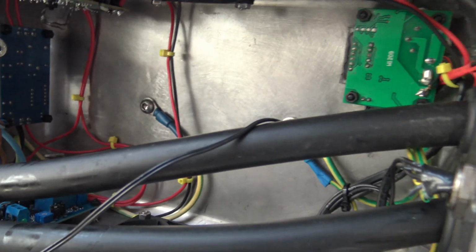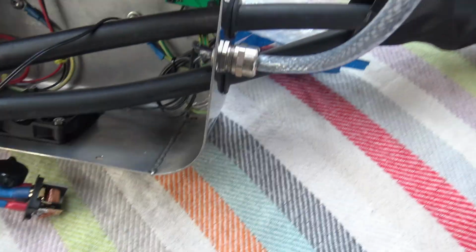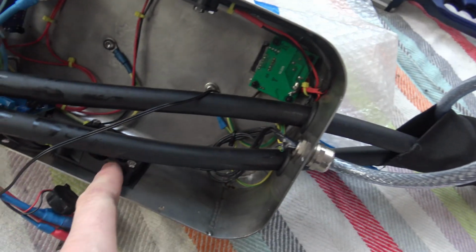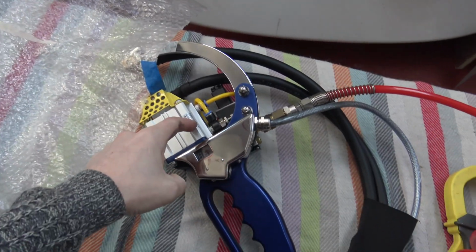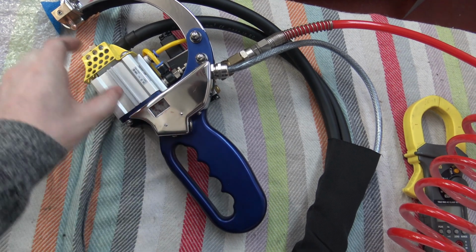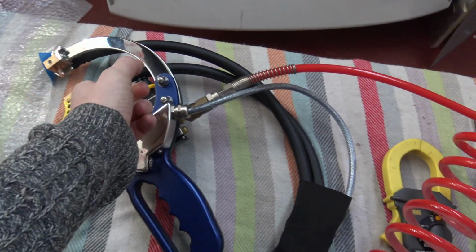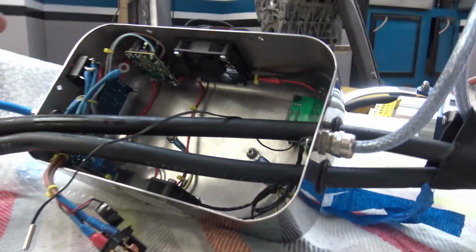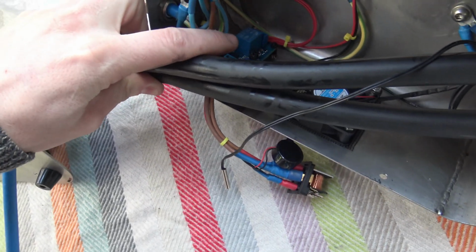And here, I'm not going to walk through the wiring in detail because it's too hard to see, there's too much going on. I talked about it in the other videos. This digital stat controls the fans. Okay, so I'm going to give it a wee quick talk-through. When I push the button here, this clock cycle countdown timer shoots a pneumatic cylinder out for say 5 seconds. Within them 5 seconds, the first second, 12 volts is sent down this SY cable into here, where you have a delay timer.